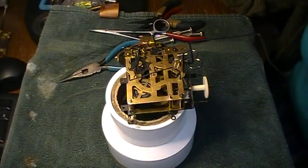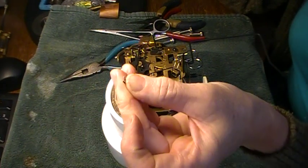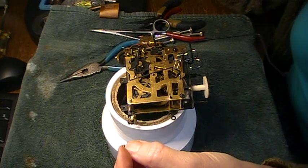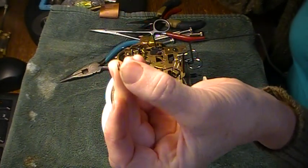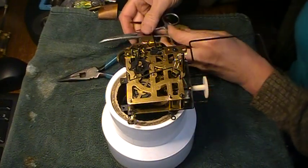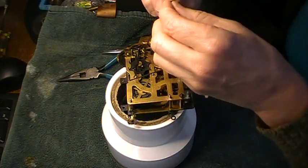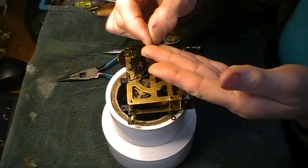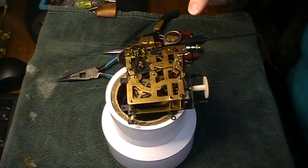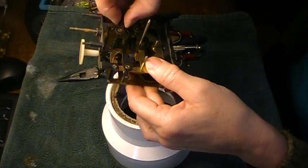Hang on. Well, that was the hardest clip I've ever taken off. You can see it's pretty mangled. That was my first E-clip ever. Or C-clip, or whatever you call that thing. Double E, I don't know. This one I got off a little bit better, but it took me and my husband twisting and doing things. We used multiple tools and finally got the two ends. If you can get one a little bit higher than the other, it loosens it enough you can kind of work it up the top of the post and get it off. So that was a lot to get that off.